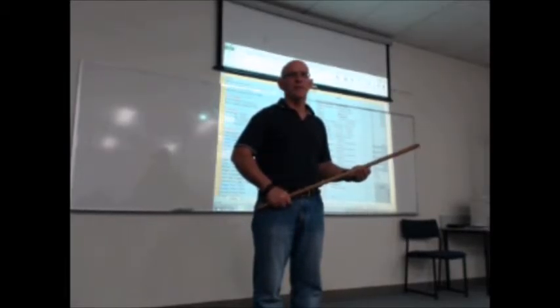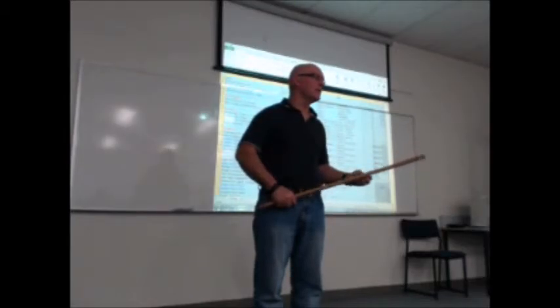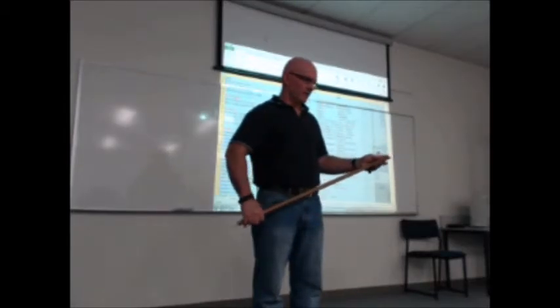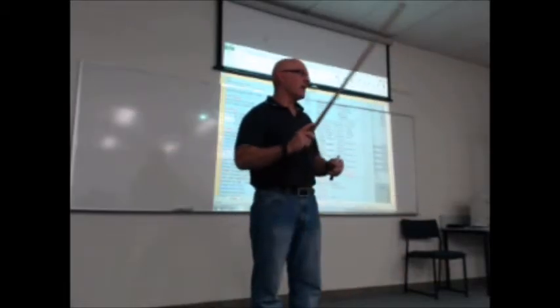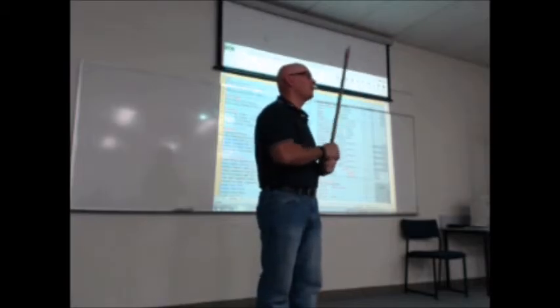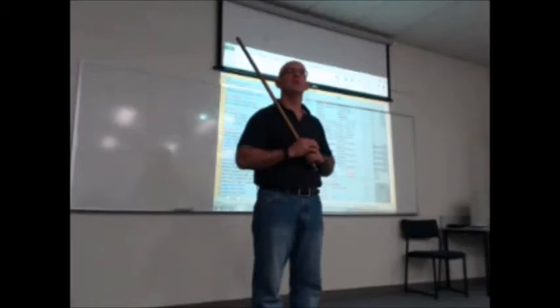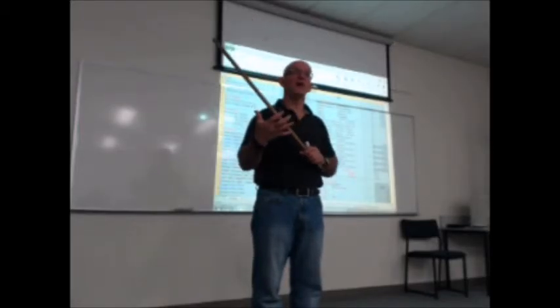From that point of view, I'm thinking anyone's actually going to go and ring up a truss company for a quote, with your engineering drawings and so forth. Yes. Have a look at a plan that's about a three-bedroom one. If you can access a price, divide it by square meterage, and just get a square meter price for what they were charging for the trusses on that. How's that? It works. And that's a ballpark.